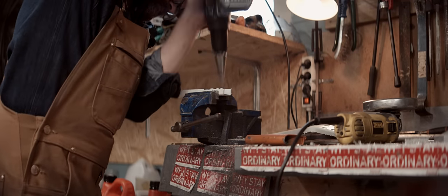Couple of seconds with high throttle openings under load, and it seems like the carb is running out of fuel. I think this is a problem. Maybe too restrictive. Could also be dirt in the carb. Should pull it apart and clean it. Next time. Found these parts all over the garage, so I'll have to do a major cleanup to find that nut.